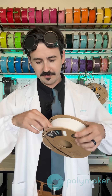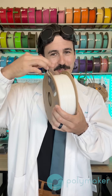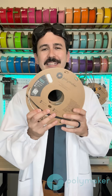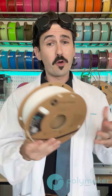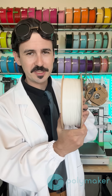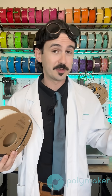And then our TPU 95 high flow. It's going to look very similar on camera, but it's actually a little bit stiffer than the TPU 95. This is closer to around a 98A shore hardness. As mentioned in the video covering just this material, you could print really fast — 150 millimeters per second with a good direct extruder should be more than possible. And this can even print on a Bowden setup, though you're not going to be able to get to those speeds. We would suggest something more like 50 millimeters per second.